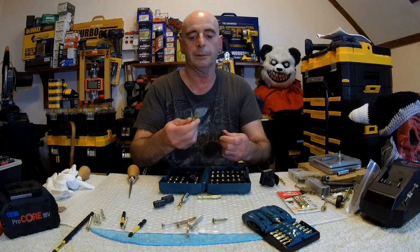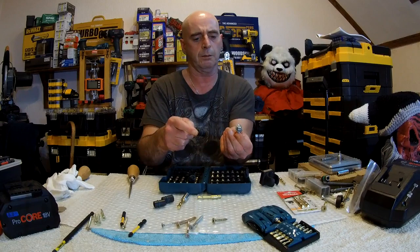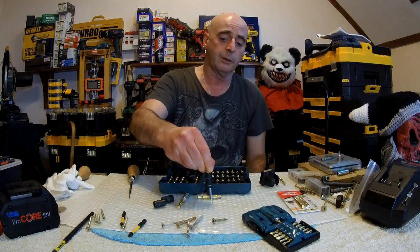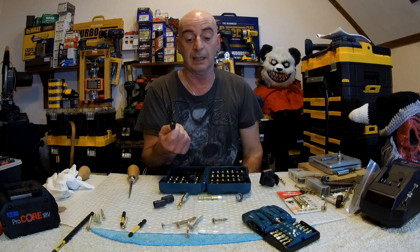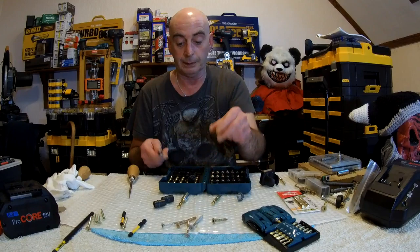Action replay on that one just to prove it — nice magnet on that one, I have to admit. It actually pushes it forward a little bit, and because the heads on these are slightly concaved in, it moves it up and lets it wobble. So to be honest, nice idea having the magnet in there — it might work better for standard bolts or nuts, but it doesn't really work with these self-tappers. So you might be better off using the plain bit.